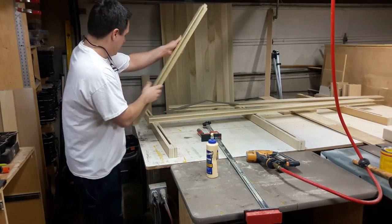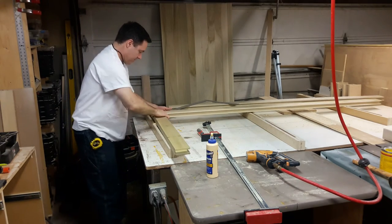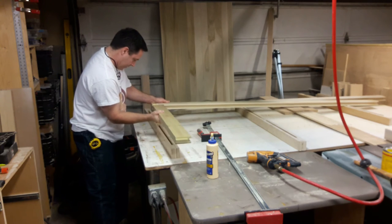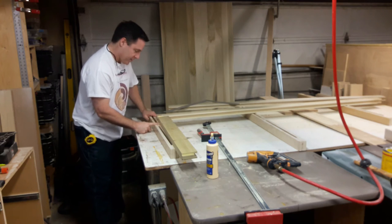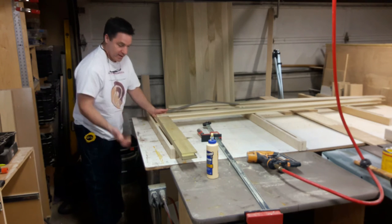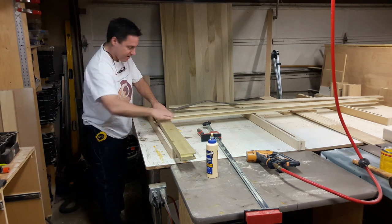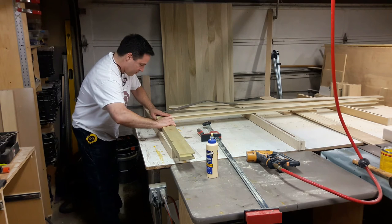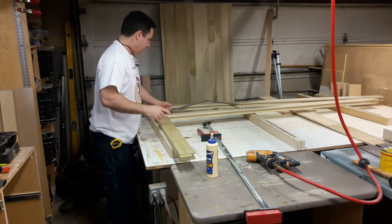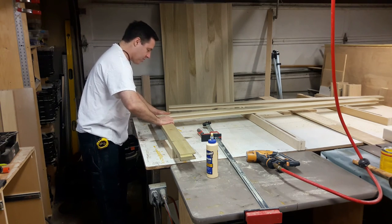It's dripping a little, but that's fine. I'm going to go ahead and put this down in here. You'll see it squirts a lot of glue out — that's fine, I'll get that with a sponge later. Now I'm going to get the glue off of this thing and get it under here with all the other glue. Now that I've got this thing more or less in there, and this side here facing me is flush, you get it flush with the top of the stile. Then I'm going to make sure that it is at 90 degrees — and it is.